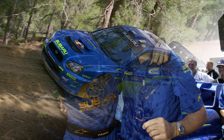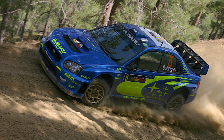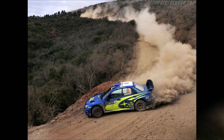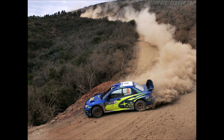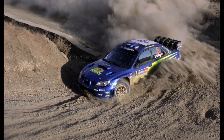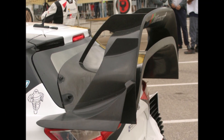The first time someone looked into vertical fins to make the car faster was when ProDrive technical director David Lapworth thought it would be a good idea to add vertical fins to the WRC Subaru rear wing. Because of the high yaw angles of rally cars, these fins create a significant side force at the very back of the car which tries to push the car back into a straight position. The result was that you can drift even faster with them, and rally teams use them until today.